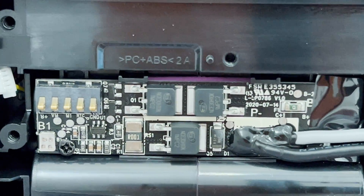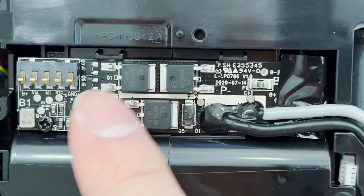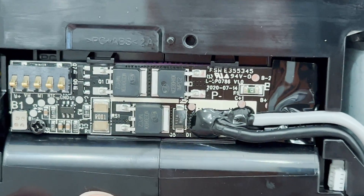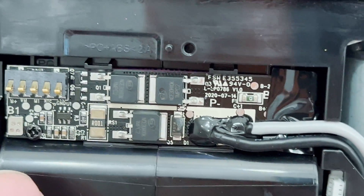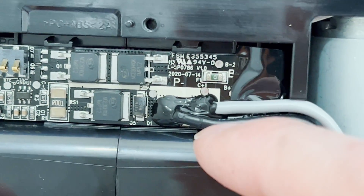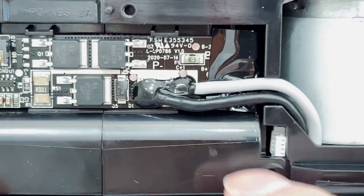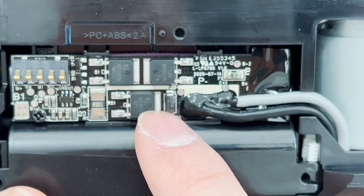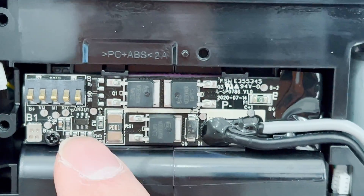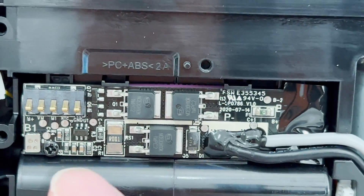Let's have a look at the battery board. Here we've got some NCE MOSFETs doing protection — it's kind of interesting there are three of them; usually there's only two. Maybe two of them are in parallel for discharge or something. These are the two thick silicone wires that power the actual motor. One of these is for controlling the motor — these are probably for battery management and this is for controlling the motor on/off. There is a current sensor resistor for battery protection as well as motor control.